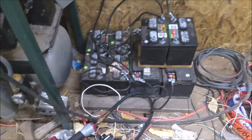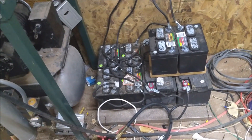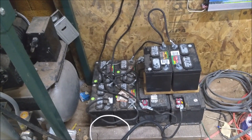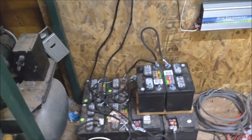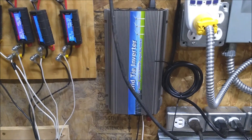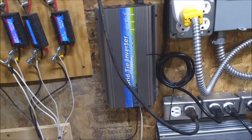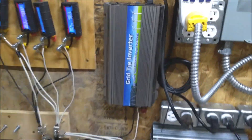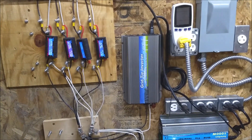My batteries are arranged in a 36-volt configuration, so bringing a 36-volt battery setup down to 22 volts is not a good idea. I do use cheap batteries — the entire purpose of my batteries is inexpensive voltage control. It just adds some drag to the turbines to keep them from spooling way out of control. Each one of my turbines is capable, in a gust, of exceeding that 50-volt cutoff.